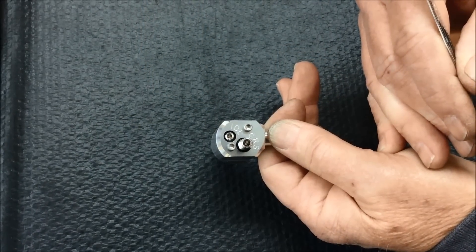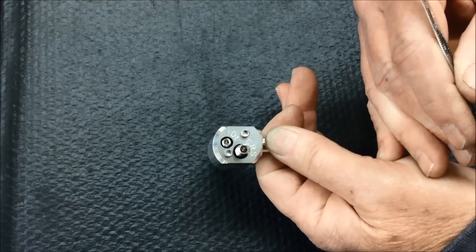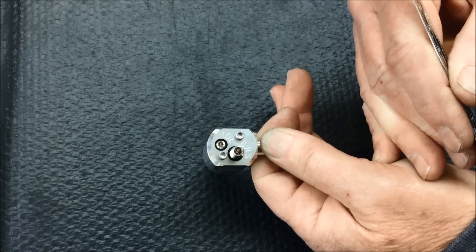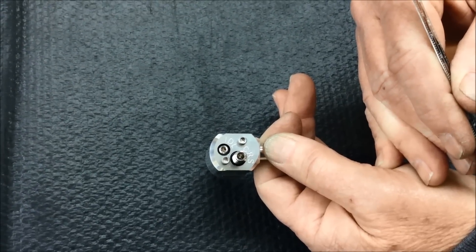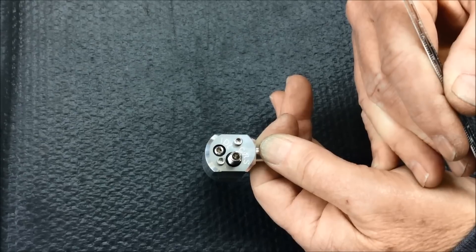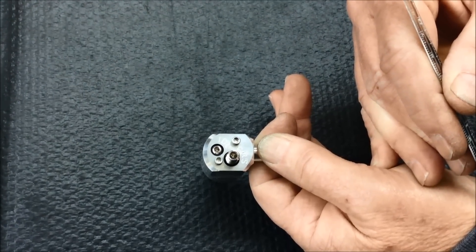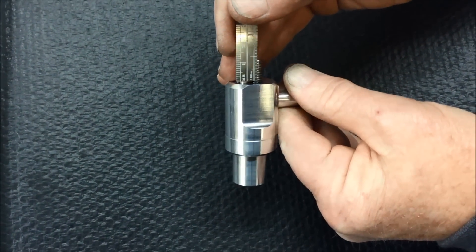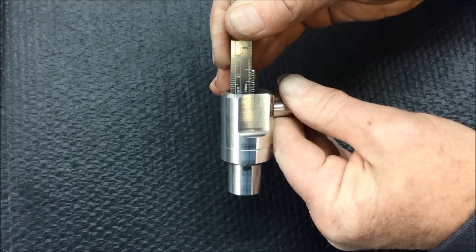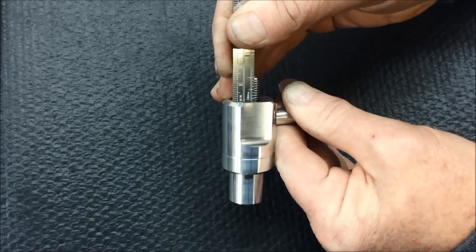The first step to tuning in dual flow mode is to make sure that the cruise circuit is disabled for initial tuning. The valve is shipped this way from ME-Wagner, but we're including this for those of you that might be retuning an existing valve. We want to disable the cruise circuit so that we'll only be working with the idle circuit when the engine is first started. To do this, make sure that the cruise circuit screw, which is labeled on the top of the valve, is about a half inch above flush from the top surface of the valve. You can also check this by making sure that the screw is 10 turns out from flush.